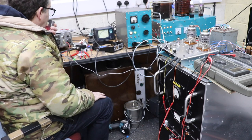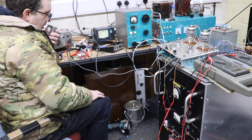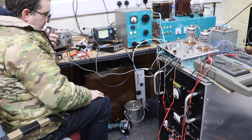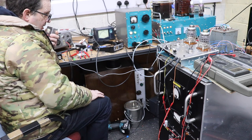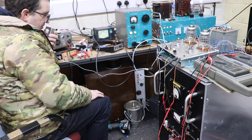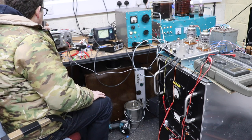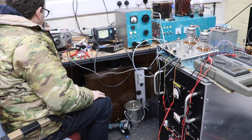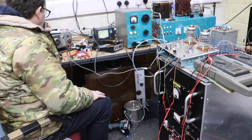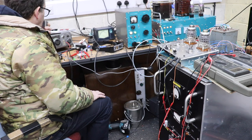GW0FZY returning. Yeah okay Ian, all copied. For the benefit of the viewers of this video: when I showed the previous clips of this modulator, I had it at a much higher HT and was getting some problems with arcing. But as I mentioned, I've reduced the HT down to 500 volts now and it's working pretty well. You're still coming through very nicely. If you could do a little video of your end so we can see what the audio sounds like being received, that would be appreciated.